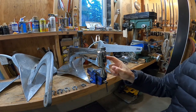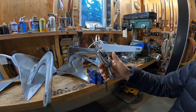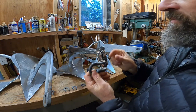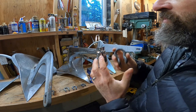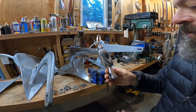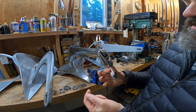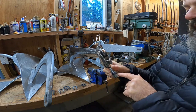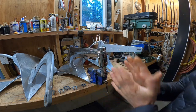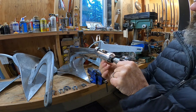This is a 46-pound Ultra anchor, and the manufacturer basically designed the attach point to use a swivel. They went so far as to not even make a slot, so you cannot use shackles in the normal boss-through fashion. I did test this anchor without the swivel and used two shackles, which you're forced to. The way the chain is secured to the swivel is: an allen screw removes the bolt, the pin passes out, and you get the last link of your chain in there. The allen set screw is held in place permanently by Loctite, and it's very clean.